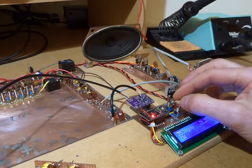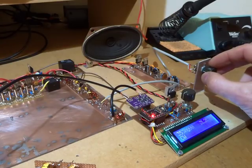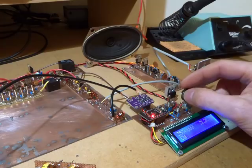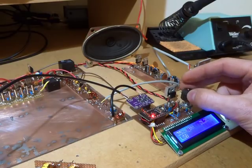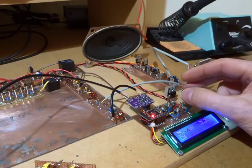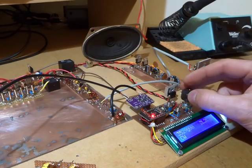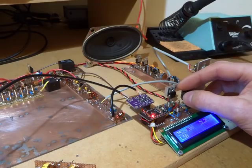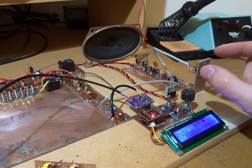It's really noisy on 80, but that much narrower bandwidth certainly pays off on the CW filter, it just cuts that noise down. See if he comes back up. There he is. It's way down in the weeds. There he is. So much easier to hear with that noise cut down with the CW filter.